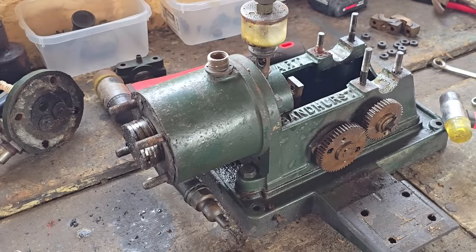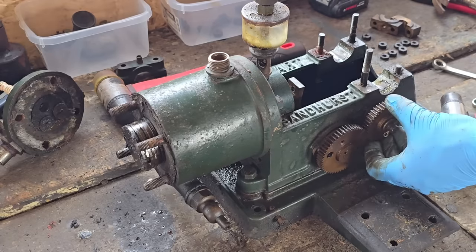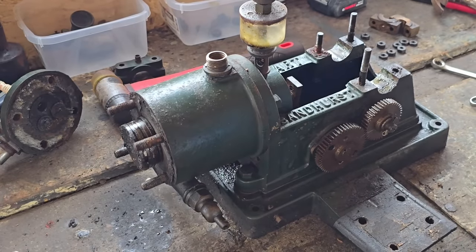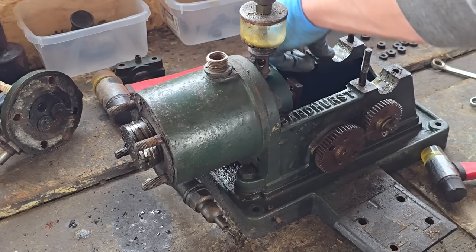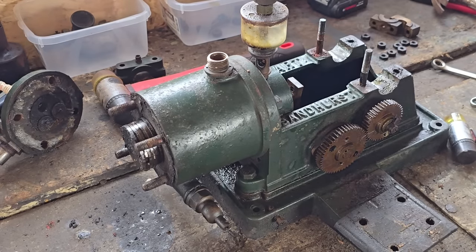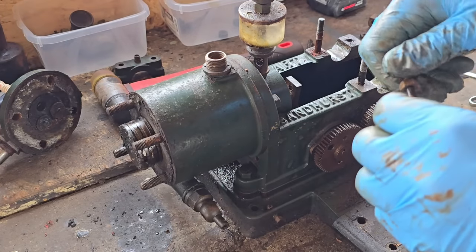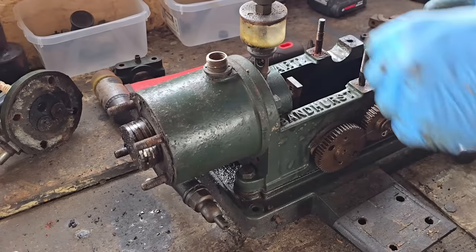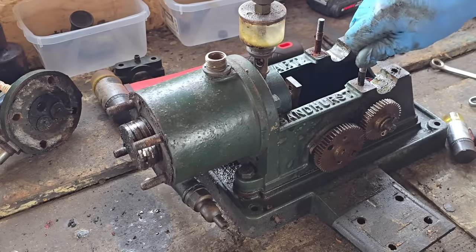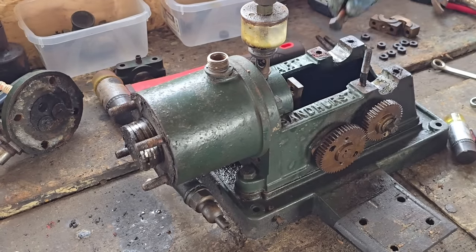So let's get this crankshaft — camshaft out of the way. We've got our marks on there at the timing. That one's coming out but these ones aren't. There's that other little lock nut we dropped — so we know where that goes. I am putting all these conrod bolts back together so we get everything matched. There is some crud in here. There's our other bolt — that one's loose in the hole but it isn't coming out.